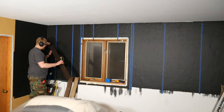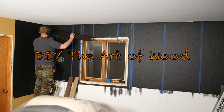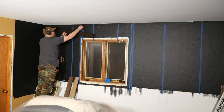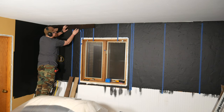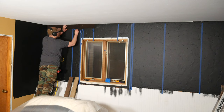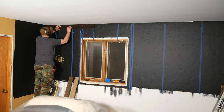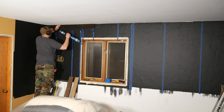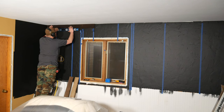If you've been following along on this project, you may have heard me mention in a previous video that I would be revealing why we painted these walls black. Today is the day. The reason is simple. The feature wall I'm installing is a wood plank product made to look like reclaimed barn wood. These planks are very rough and weathered, and many of the edges are slightly warped or not straight and square, giving them the authentic weathered wood look. This does establish that warm, rustic look we are going for, but it does create one minor problem. Since the edges of the planks aren't straight, many of the boards don't fit flush with one another, creating gaps here and there that allow you to see the wall behind the boards. Previously the wall was a light blue color, which would have been very noticeable through those gaps. The solution? Paint the wall black and those gaps will basically disappear.